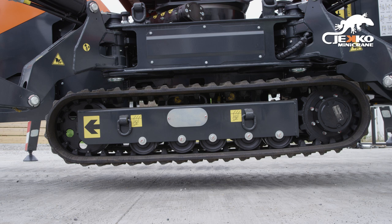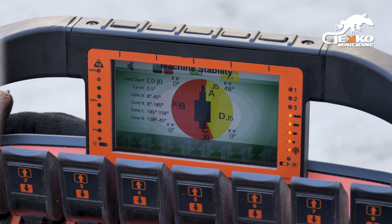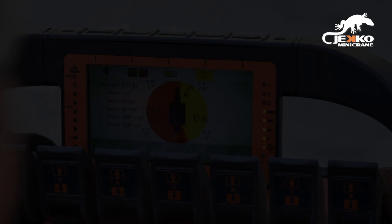Outrigger opening mode allows you to hydraulically activate the rotation and extension of the outriggers. This screen displays the working load chart per working area of the machine. Using buttons 1 and 5, you can scroll through these five pages regardless of your current working mode.